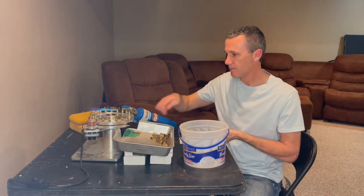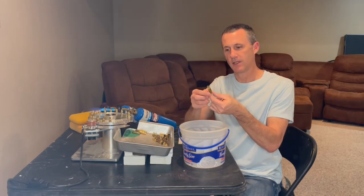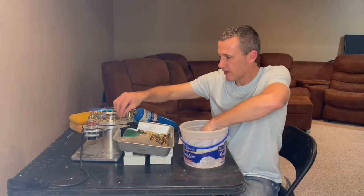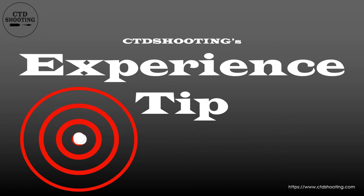What I'm looking for when I set my annealer up is a deep gold color that's still shiny, halfway down the body of the case and then up to the neck. It's pretty quick, very uniform, and that is it for step four, annealing. For competition brass, I will anneal every off-season no matter where they're at in the round count. During the season, I will wait for three to five firings and then anneal. For hunting brass, I anneal after five firings, but only in the off-season.